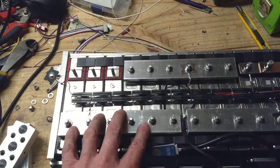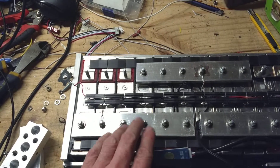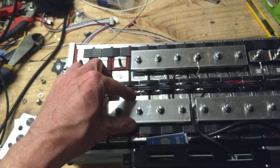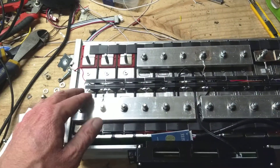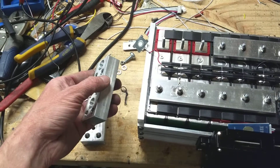That's why these bus bars have to be so big — as you're going from cell to cell to cell, you're building on your amp load through your bus bars. I could make these bus bars tapered, but that would just be more machining and make them more costly for no reason. Alright, so now we're going to jump over to the lug adapters.